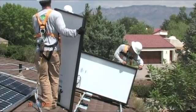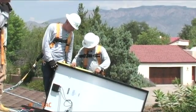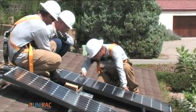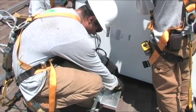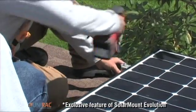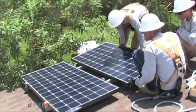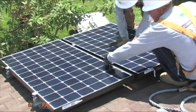The contractor marked the module frames earlier — it's a lot easier to do such things on flat ground. This is going to really help him align modules as he goes and not rely on a bunch of adjustment at the end. The installers will connect the module leads before positioning on the beams. They will then slide a pair of end clamps in place, tighten them, and get the next module. Between modules, a mid clamp is inserted to hold down adjacent modules.